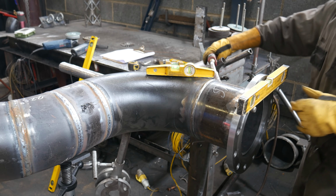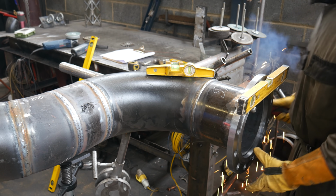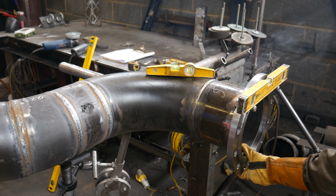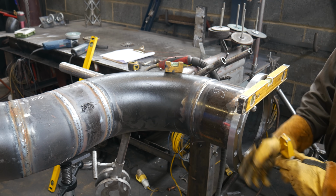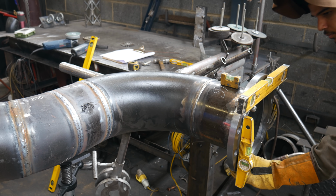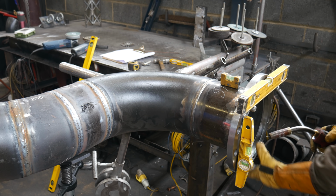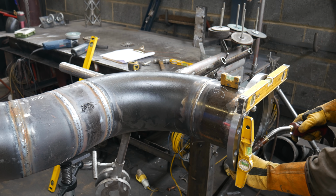Now that's my tried and true tested way, but if your cut isn't straight, you're not going to get the right measurement, so it comes with a pinch of salt, that technique. Another way, again, if your chop isn't quite straight, it can throw it off, is simply measuring from your cut of the pipe to the center of your weld, plus on what the center of the elbow is. In this case here, it is 305 mil to the center. So that will be them two measurements plus together, minus again from the overall, and then it will give you how far it has to stick out.